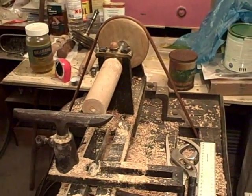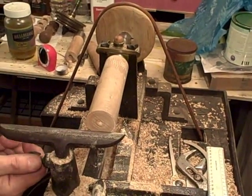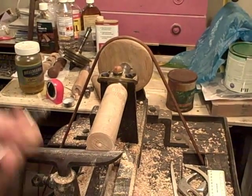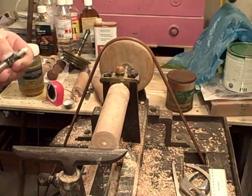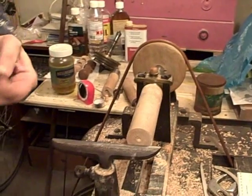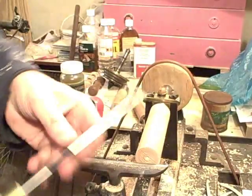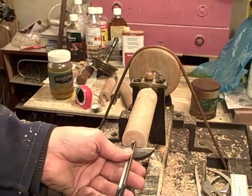That was my marker for going into the lid — I've left that on there. I'm going to drop that down a little bit so I can go centrally into there. I've got to go right into the middle of that — otherwise I'm going to make a hole bigger than I actually want it to be. I think that's about central — so I'm going to go for that. Normally I wouldn't measure this — I'm just giving you an idea how to measure. I'd normally use the vernier calipers to find out how far I'd gone down, but on this occasion I thought if I had it marked with a bit of tape, you'd be able to see it without stopping and checking with the verniers all the time.